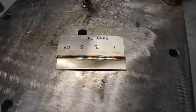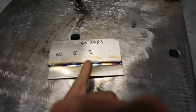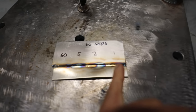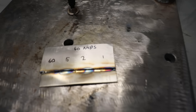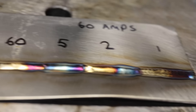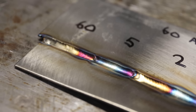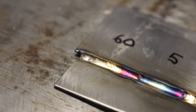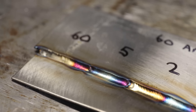So this is straight DC at 60 amps using the trigger. I've run through different pulse settings — the only thing adjusted is the hertz, which controls how fast it's pulsing up and down. That's set to 1, 2, 5, and 60 — goes all the way up to 200. You should be able to see that the ripples are a bit more spread out at 1, getting a bit closer at 5, quite difficult to see the definition but still visible, and by the time you get to 60 it's all blended in. Anything above that you're not really going to see it. Five is really painful to look at — it's like watching a strobe.